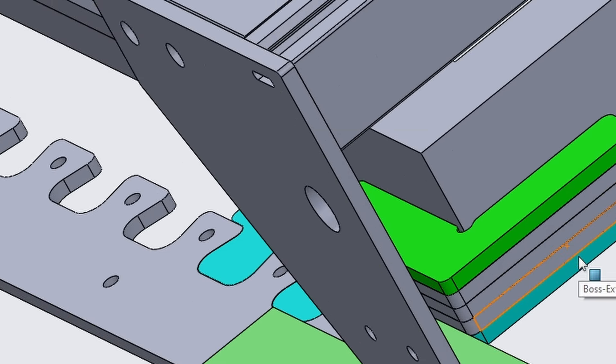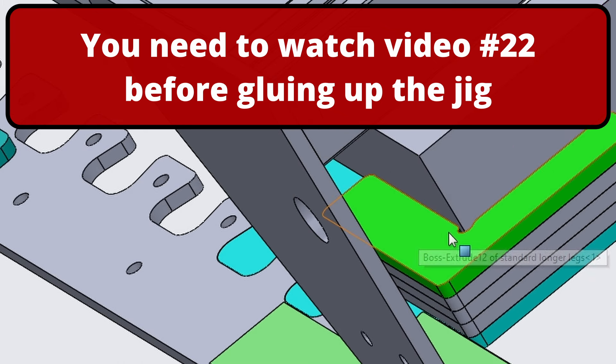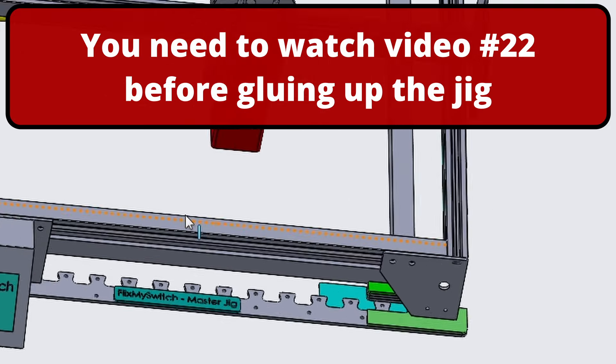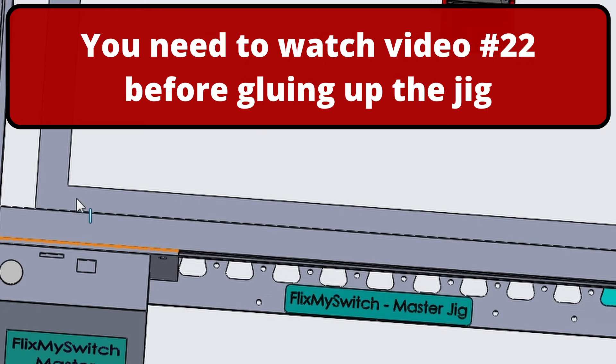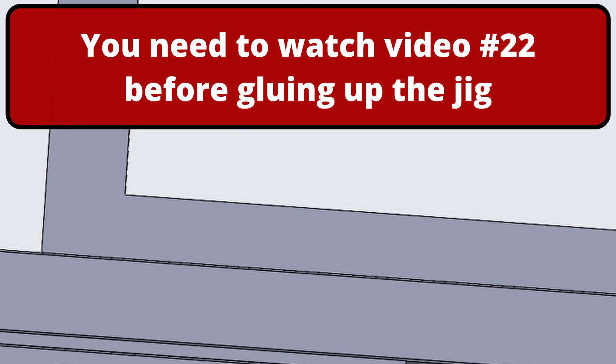Once this is all assembled and we position the honeycomb in its right position, we glue this top green section in, let the glue go off for half an hour, and then the honeycomb is locked in position. Once the honeycomb is locked, we can reference our parts from here because the frame of the honeycomb sticks above the honeycomb material — which I'm not showing because my graphics card really doesn't like it.